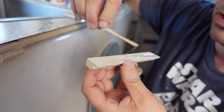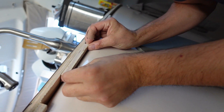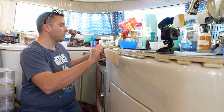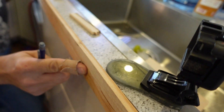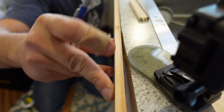So this is my solution. We've cut these — I'm calling them nuggets. We're going to glue them in so that they fit like this. Building up the front edge of the wood gave me a nice surface area to apply the cherry trim. These strips are going to go on the front, but as you can see there's a nice gentle curve. So we need to get this up and on here like that. I want there to be about a quarter inch overhang here.